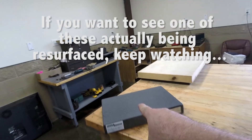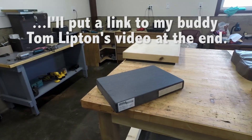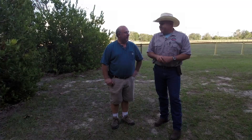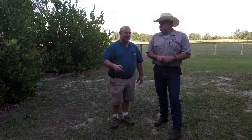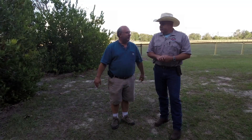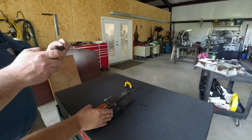Here's mine. He graded that one an A or double A — I think he graded it an A but said it was a double A, it was that close. My big plate that I brought in, when they first did the repeatability, it was out by eight tenths, which is almost a thousandth of an inch — that's not good. But he lapped it down and we got it to within twenty millionths of an inch repeatability.